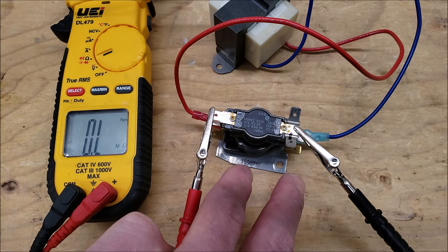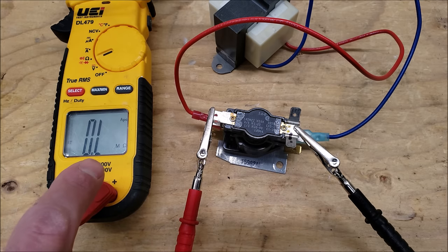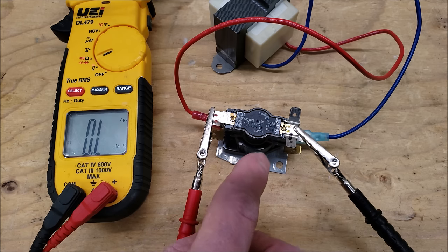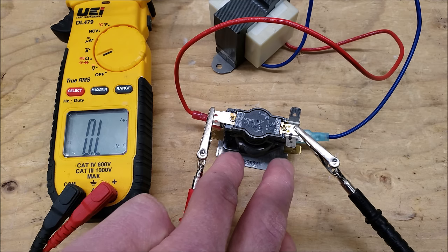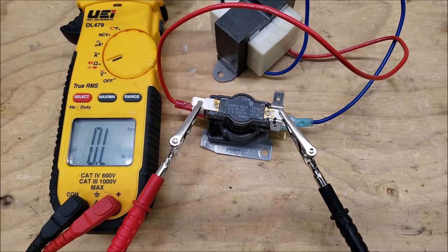That's how you troubleshoot these. Apply voltage, make sure that when contacts are closed you're reading 0.0 ohms of resistance and it's meeting the time requirement. With the power off — 24 volts off the pan heater — you can check the resistance value of that pan heater and make sure you're not reading OL. If you're looking for the multimeter or other tools I use in the field, I have them all linked down in the description section below.